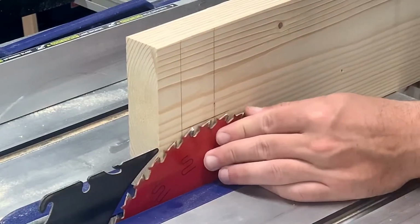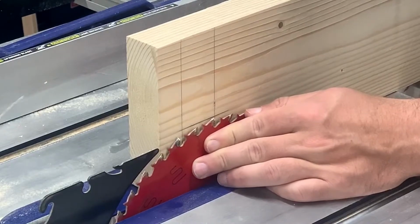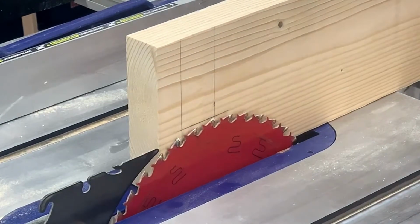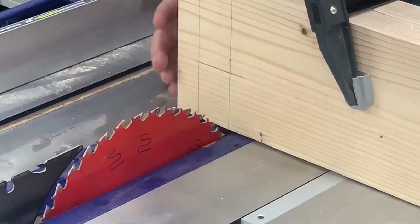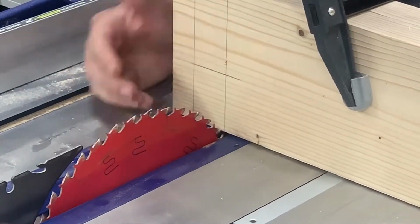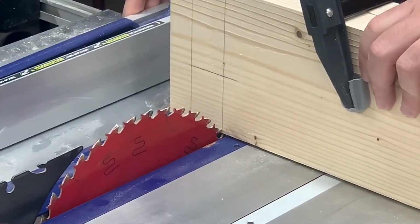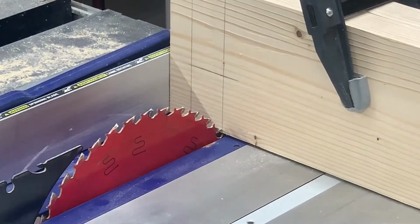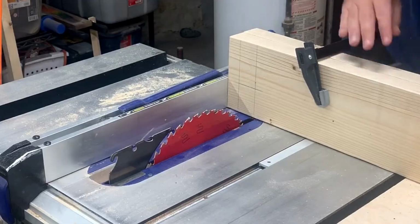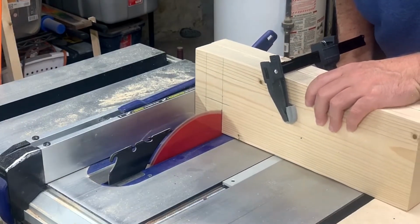Over at the table saw, I set my blade height. The height doesn't need to be accurate, just consistent so that all the legs look the same. The width of the lap joint does need to be as accurate as possible, since this is just going to be a friction fit. I cut all the boards two at a time to be a little more efficient, since these repetitive cuts on the miter gauge get tedious with larger pieces.